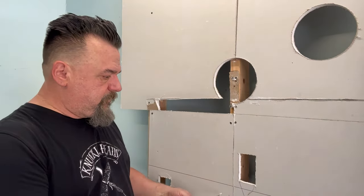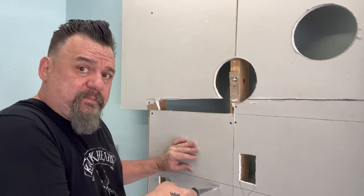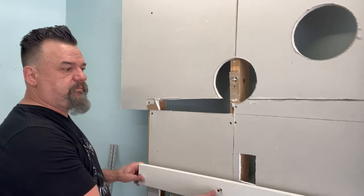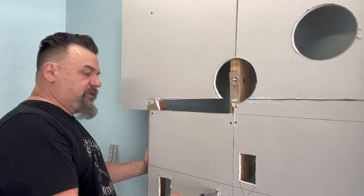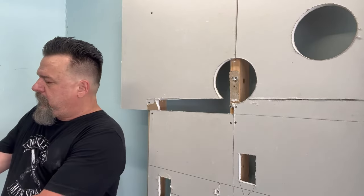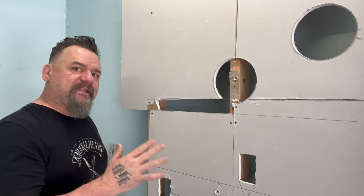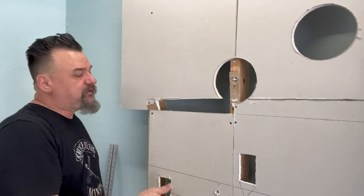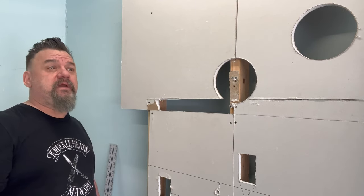Right on each side of the stud — they don't even have to be perfect. You can knock holes with your hammer, make it easier and just drill through. It doesn't matter because when you put the trim back up, you're not going to see it anyways. Don't go above or beyond your line. But we don't know if there's wires going down — that's the little bit of the downfall. If you make a big hole here, the baseboard is wobbling on the studs. It's a great technique, but you can run into some trouble.